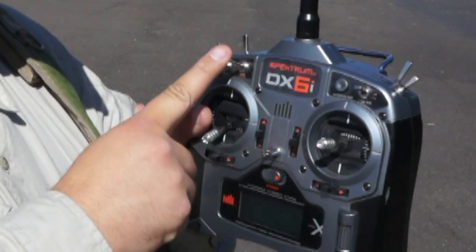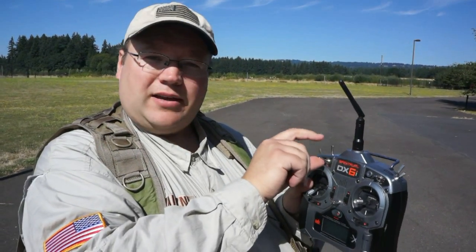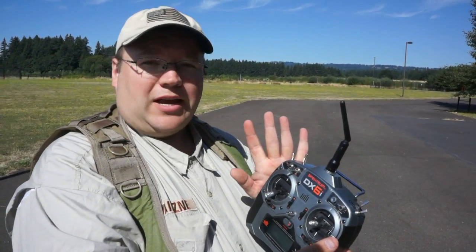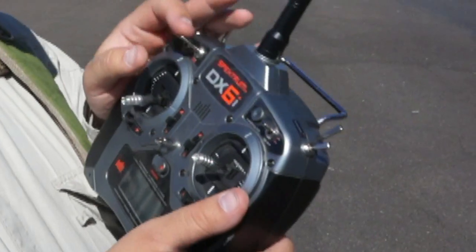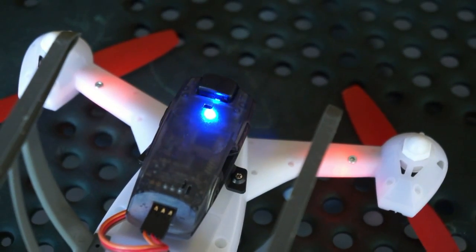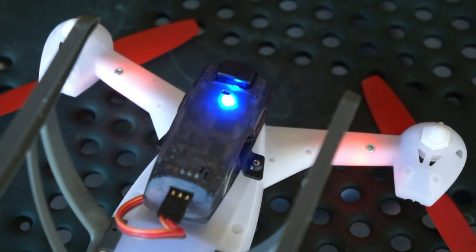I'm going to go over quickly how to access the camera from the radio. It's currently bound to this switch. To take a still photograph, you turn the camera on — it's in still mode by default. Just toggle back and forth: one photograph taken, keep doing it as many times as you want. To switch from camera to still mode to video mode, hold down for four seconds and back up — you're in video mode. Same thing to start and stop recording. To verify: in still mode, when you flip the switch it blinks once; flip again, blinks again. In video mode, when you toggle it, it blinks on and off while recording, then back to solid when you toggle it again to stop.